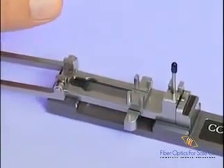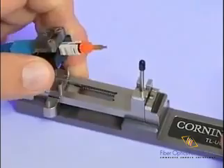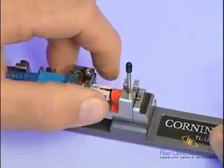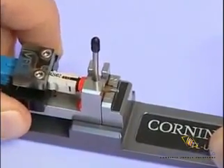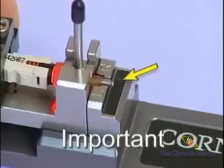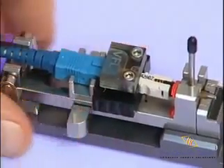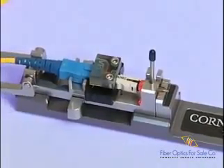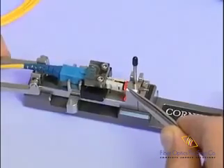Ensure that the connector carriage is oriented with the wide opening facing the wrench handle. Pull the winged slide of the Unicam connector tool back to the end of its travel and insert the lead-in tube of the Unicam SC connector into the wrench area of the tool. There may be some resistance; minor adjustments of the connector body should allow the connector to slide into place. The lead-in tube should rest on the crimp platform when fully inserted. Slowly allow the winged slide to retract toward the wrench handle and engage the CTS adapter. Do not force the connector — if it does not slide in easily, check that the wrench handle is up, the cam is in the open position, and the connector is oriented properly.